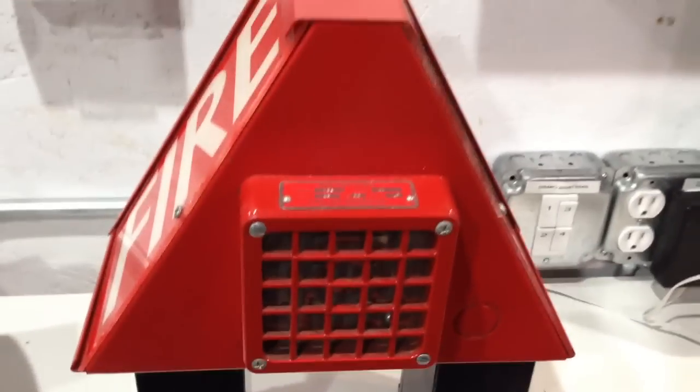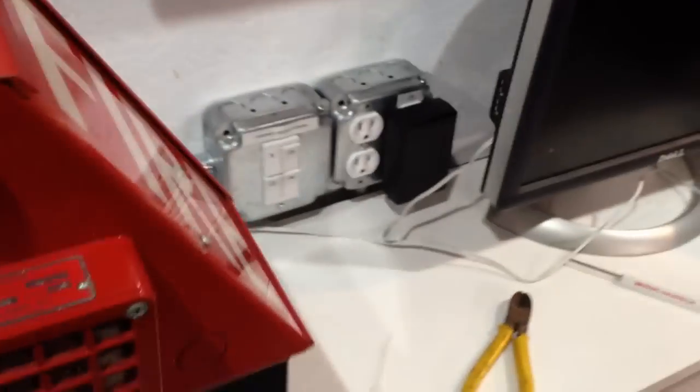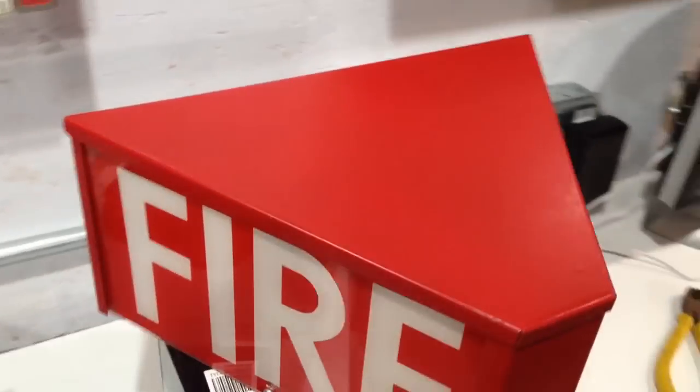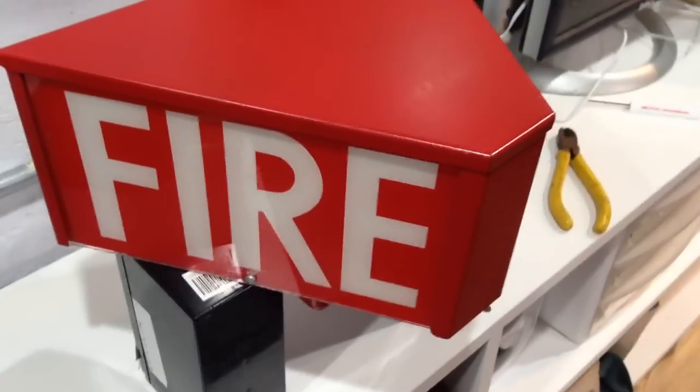What's interesting though is it's 12 volts — a 12 volt horn and 12 volt light. But what makes this thing a little unique is it's got a car turn signal flasher in it, a thermal flasher, and that makes the light blink and the horn pulse.